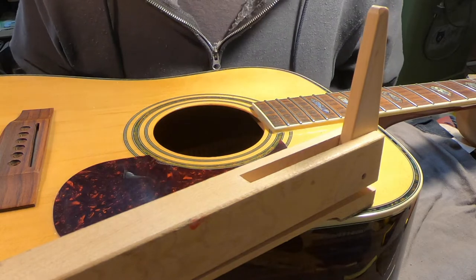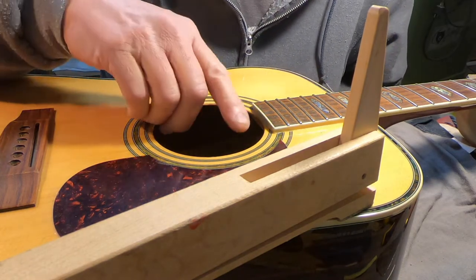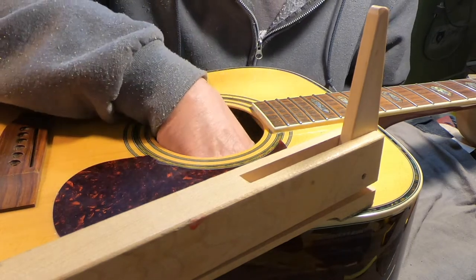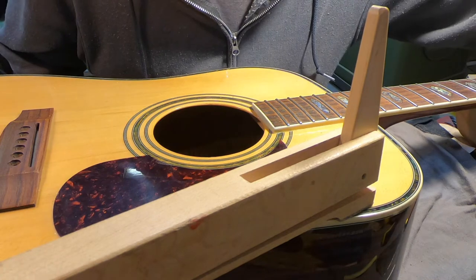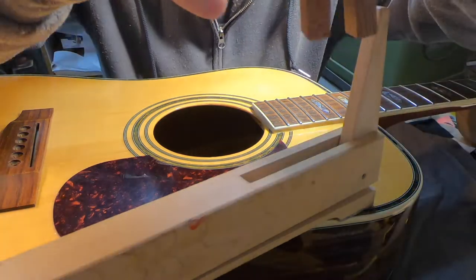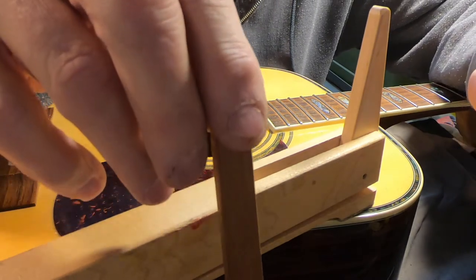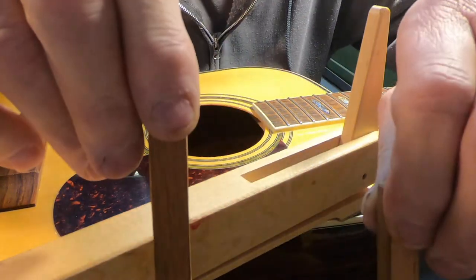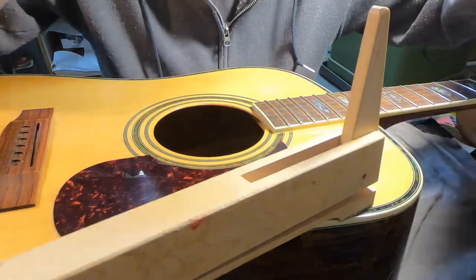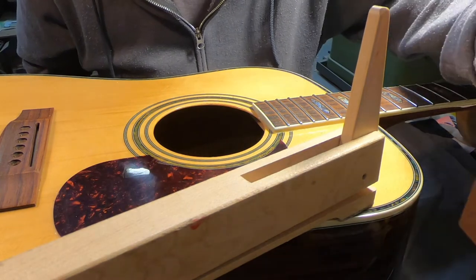So what I like to do, in this particular instance, is I used a little screw clamp, which I will show you. It's like a post, basically. I checked the post to see if that would work. I had a couple different ones here that I use for inside brace work that you can just basically rotate in between braces, and if I can ever get in the camera, there we go. You just stand it up between braces and it applies pressure in varying lengths.